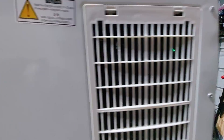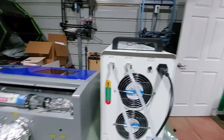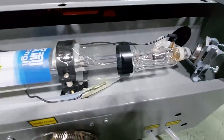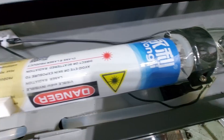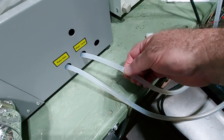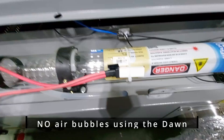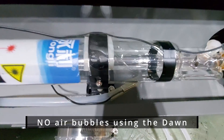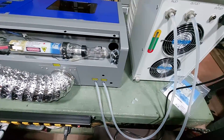With the chiller started, move around to the back and do a leak test first — make sure nothing is dripping from the right side outlet or the left side inlet, and that the entire bay is dry. If you get an obstruction or kink in those tubes, the alarm will go off on the chiller — that's one advantage of using the chiller. I've now attached the exhaust hose and connected it to the air purifier, so this machine is ready for its first run.